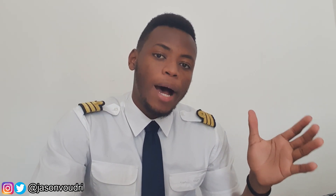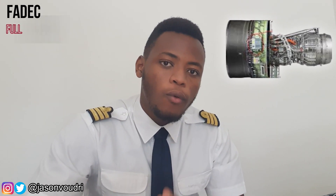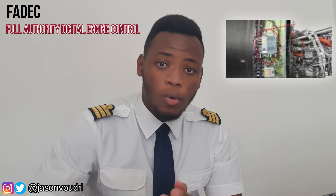Let's move on to the pilot's point of view. It's important to know what the FADEC is. FADEC stands for Full Authority Digital Engine Control. It is a computer with two channels — one active and one standby for backup. Each engine has its own FADEC. The FADEC monitors and controls the engine for startup and during its operation, whether on the ground or in flight.